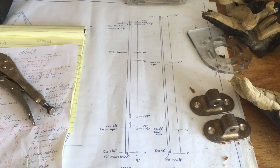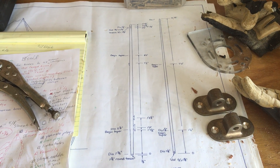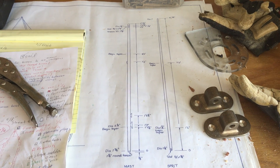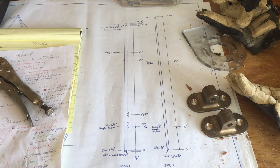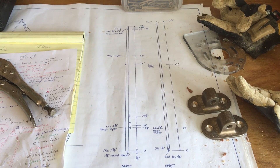We're going to talk about how we made the mast and set up a box jig so we could rotate the blank. We took the four-sided blank down to eight-sided on the table saw and then we put a couple of dowels in either end of the blank.